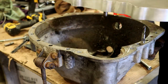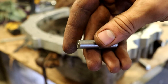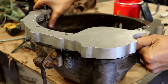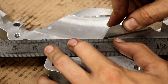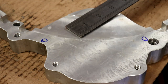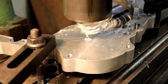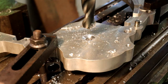One of the perks of having the original bell housing now is I can use it as a pattern to mark the location of the starter. You can see I'm using a little transfer punch I made to mark the original holes of the starter mount. When I flip this over, those holes don't line up too well — one is very close to the edge and one is very close to another hole in the adapter. But that doesn't matter because I'm only using these locations to mark the center of the starter so I know where to machine out the main bore. I'll adjust the bolt holes slightly later for them to line up somewhere more convenient.